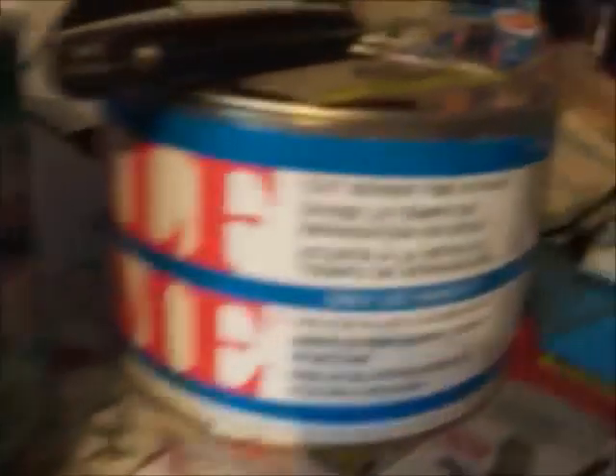I like the way James Freddy says a butt weld is the best because then you don't have the excess metal underneath trapping moisture and rusting out. But I don't weld enough to be that good, so I want a little something back there. The only places I'll be doing a butt weld are on the sides. I'll flip this over and soak all those weld areas with epoxy, then get some undercoating in there, lay some filler on the weld areas, prime it, and then get this lid painted.